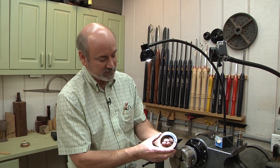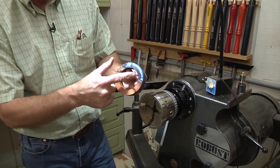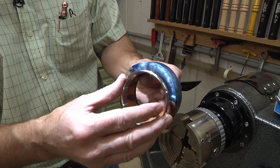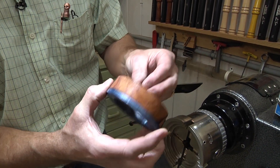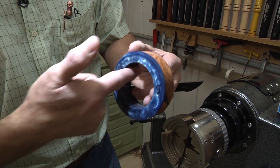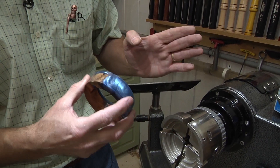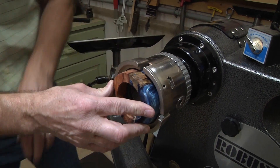What he does is expand jaws into this right here, but he's only holding it halfway, and then he starts cutting this diameter because the first step is to get this to fit. He has to then very carefully turn it around again, have it flush and do this so the inside cut is parallel. I kept thinking about that - is there an easier way to hold this? Look at the step jaws. So I'll just put this in here like so.